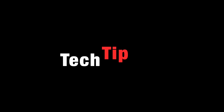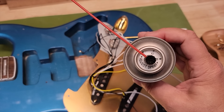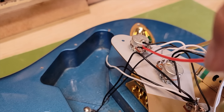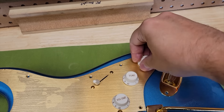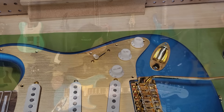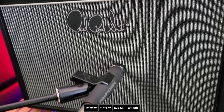To fix the crackling potentiometer, we're using Deoxit — you can also use electronic contact cleaner, but I like Deoxit for its controllable spray. Put the straw right into the little slot on the pot, let it work in, and flip it over. Already feels much nicer and loose. Wipe up any excess with a dry cloth. Now switching the SunZero over to the overdrive setting with the bright switch on — same SM57, same everything else — let's check how the guitar sounds with overdrive.